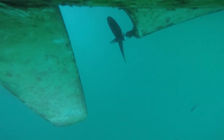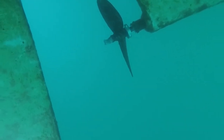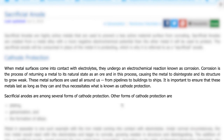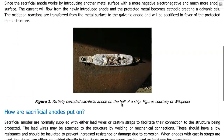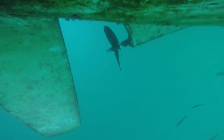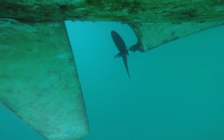What are we up to tomorrow? I'm gonna get into the water and fix the anode. We have one on the prop at the back that's totally eaten and we don't know how well the other boats are protected — if they don't have anodes we're going to be suffering even more. I got a donut anode on recommendation of Dean, thank you so much. It's a thin one, round, and it goes behind your prop — I'll show you in a GoPro clip. It's a bit thinner than the ones I've seen but that's perfect because we don't have much space. When metal surfaces come in contact with electrolytes they undergo a chemical reaction. Sacrificial anodes are used to protect metal structures from corroding — they work by oxidizing more quickly than the metal they protect, being consumed completely before the other metal reacts with the electrolytes. Boat people use anodes to protect their prop, their shaft, and eventually even their engine from corroding.